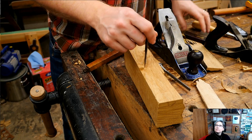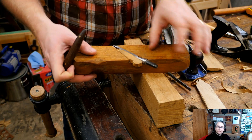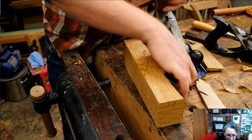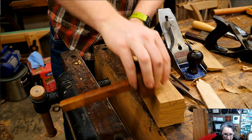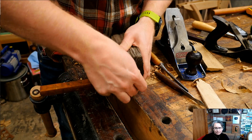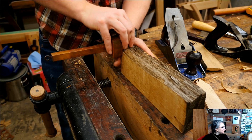I've got a quarter-inch chisel, make my mark, then I've got a quarter-inch groove, then I've got my fence. The fence isn't just about being thick — it gives rigidity to the whole plane. Over time the plane may want to twist and bow; having more material here will resist that. I'm going to make the fence about three-quarters inch, so this needs to be an inch and a quarter — actually I'll go an inch and three-eighths to give a little wiggle room. I'll use this marking gauge to run all the way around.